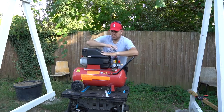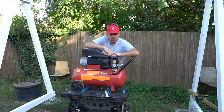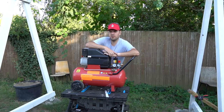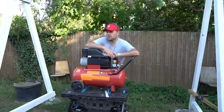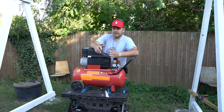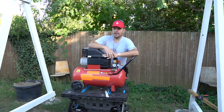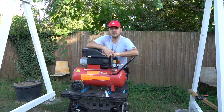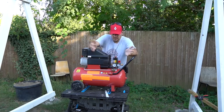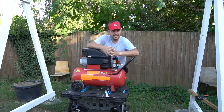Final summation — air compressors, oil free, oil lubricated. There is not a wrong compressor, there's only the wrong compressor for the wrong purpose. If you are nailing with your compressor with air guns or nailing guns, you can buy a small compressor — 25 liter tank, 2 horsepower — this is far enough. The common air compressors that roofers use are even smaller, they fit into small boxes. This one is a 50 liter, 3 horsepower standard compressor for homeworkers. I'm pretty happy about it, I like to work with it.